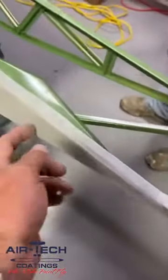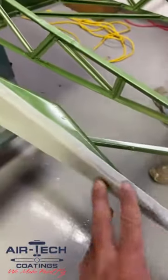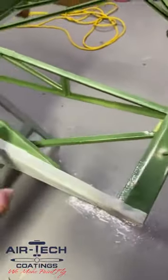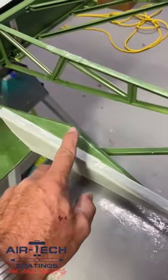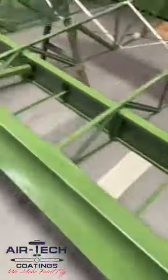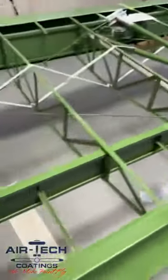We like to cap, which this one's got solid wood in here, but when it's open, lay a piece in, that way everything will lap down over it. You don't have a raw place in it. Make sure you got your ends trimmed out good. Take an iron. Then once it's in, don't forget, you have to put more thick glue right here. Fabric will stick to it after you've glued it down, but you need another base just as if there was never a piece of fabric there, just like you did here. So you go around and check everything and make sure that you've got that extra bit of glue right there and around the side.